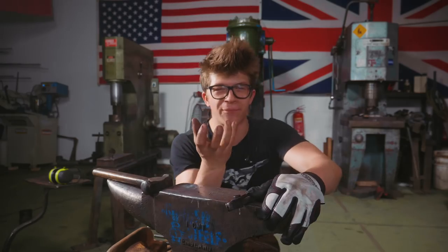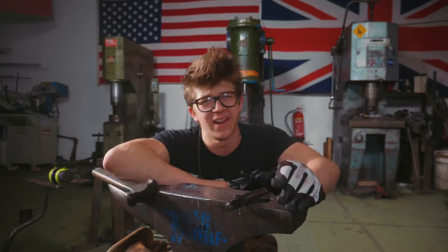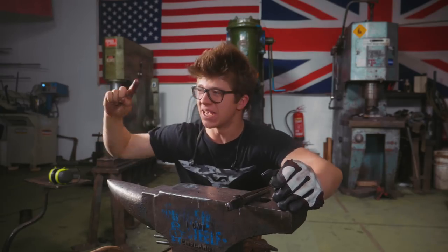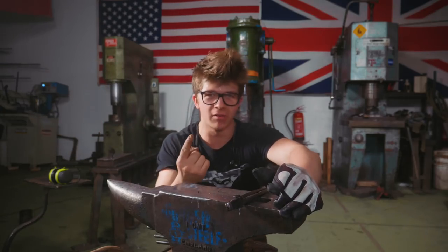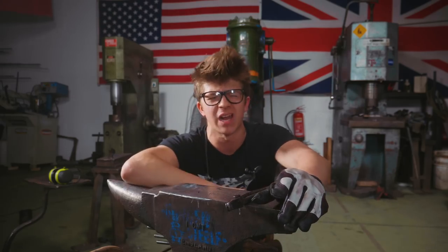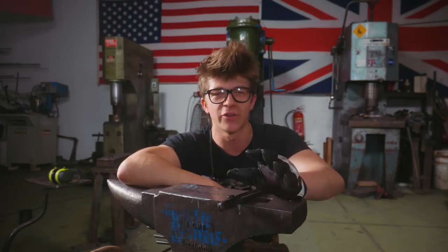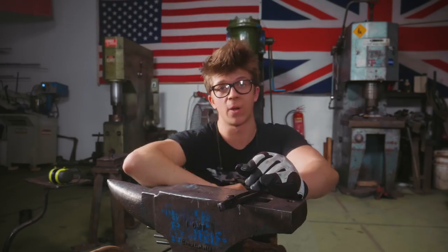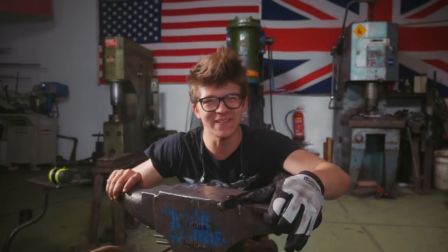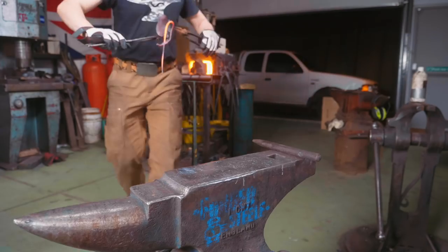Okay, we have a cup formed in it. We got the leaf bent. It's looking nice. The little stem there, it is whipped around, and we're gonna bring it around, and we're gonna work it up a piece of 20 millimeter round, 3/4 inch round, roughly the same diameter as any candle that'll go in it. And we're gonna go up the whole thing, and that's gonna hold the candle. Lots of fun, enjoying this. I don't get to do this type of work often.